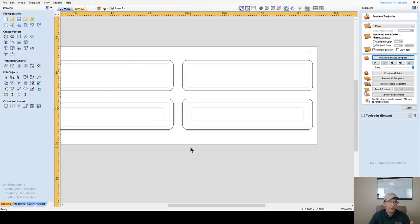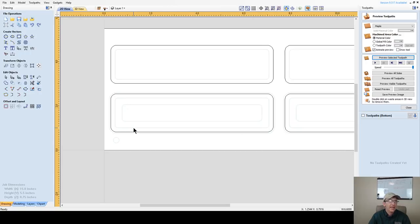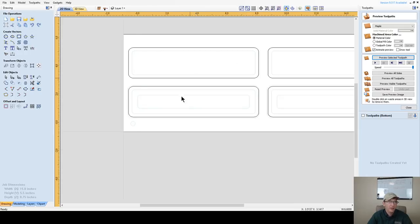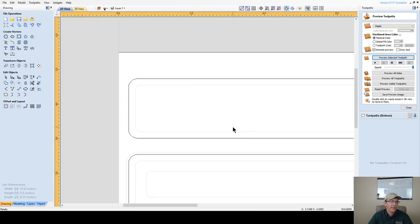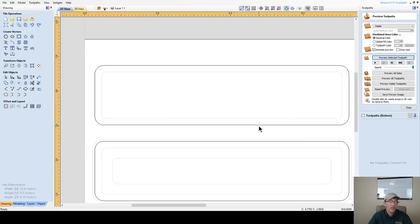I'm going to come in here and work in here. On my tops, because I'm flipping along the Y, imagine that board getting flipped over. My tops, the lids to my boxes, are on the top of the board up here, and my bases are down below. On the tops, let's start laying out our carving. Now, remember this inner area here, that's the area that's getting pocketed out to about 3/8 of an inch deep,